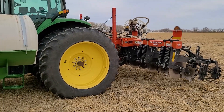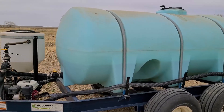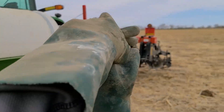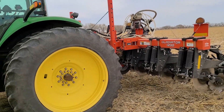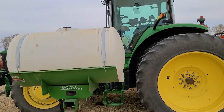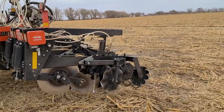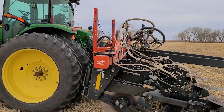So what we're pumping in right now is 32% nitrogen. It goes into our tanks there and then the plumbing goes over there. I'm putting about 25 gallons per acre down — not very much per acre, but you get about 4 pounds of actual nitrogen per gallon. Quick math. Works out really good for us. It's an easy system and it doesn't take too long to fill up the tanks.